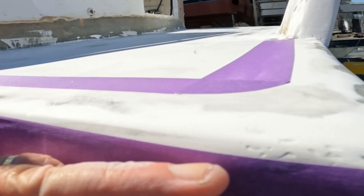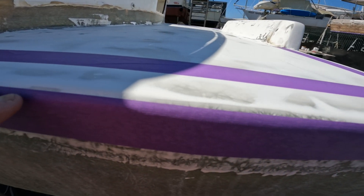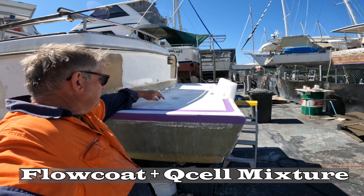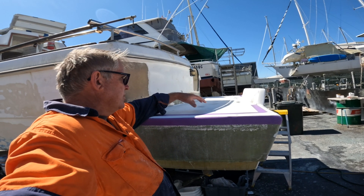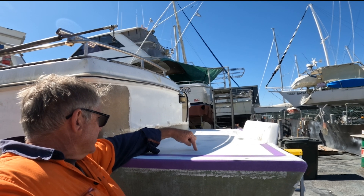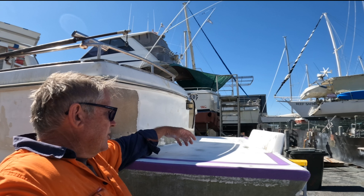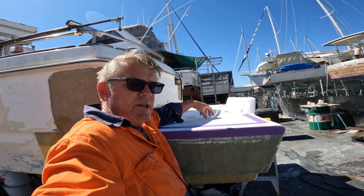Let's have a closer look — you can see a couple of imperfections there and a few more scattered around the place that I've got to fix up. What I've done with the rest of the transom is used flow coat with q-cell mixed into a thick paste, layered it over a couple of coats. I haven't decided yet how I'm going to finish it off — whether it'll be a non-slip flow coat coating, EVA foam, or something else — but I need to make that decision soon. Let's mix up this flow coat with the q-cell.